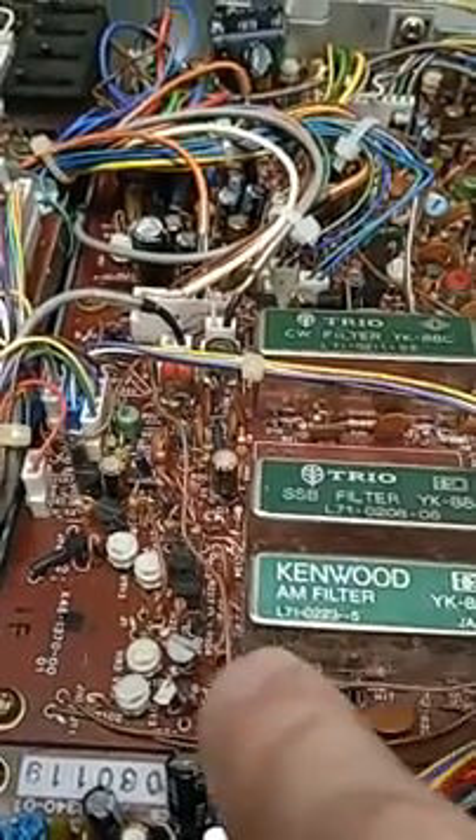It is not good enough to just take the old capacitor out and solder a new one in — there's a procedure to error-proof this process. Find the capacitor to be removed, note its orientation and where the minus mark is, make a mark on the board with a pen if needed, and check that orientation against the silk screening or legends on the board. Note that in the HP 651 generator, there's a capacitor installed backwards from the factory — a very bad mistake because they can explode.